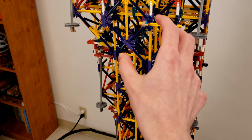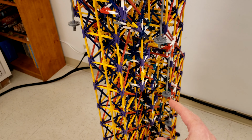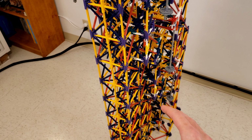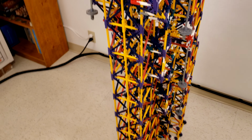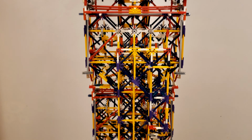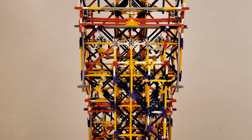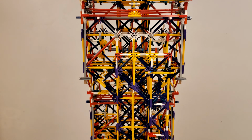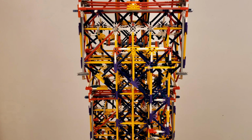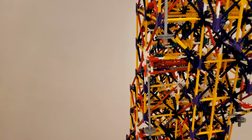So that's what this whole new pathway back here is for, to just catch the discards and get them out of the way, though they do end up in the same place in the end. It's a quirky bit about the full adders that they take in 3 inputs, but only 2 of the outputs are really useful. So you just have this odd discard ball that you don't need, because you only need the sum and the carry of the full adder, and you have to put that other ball somewhere. So that's what that's for.